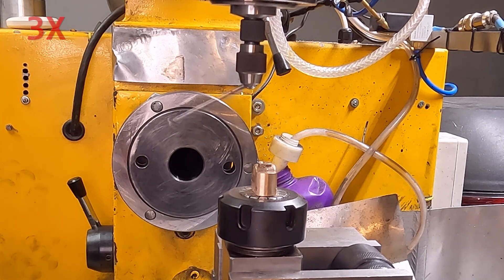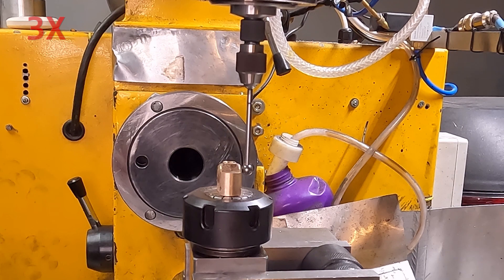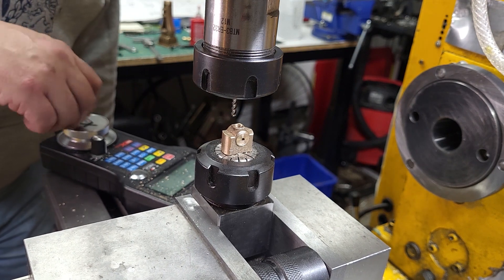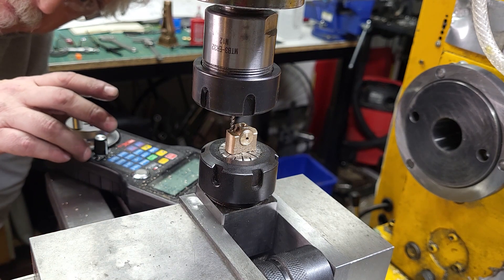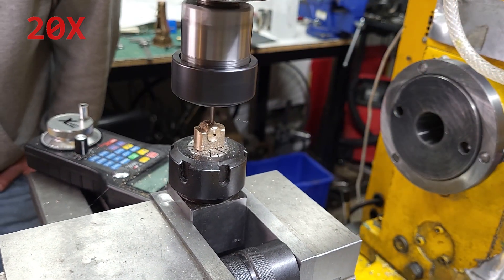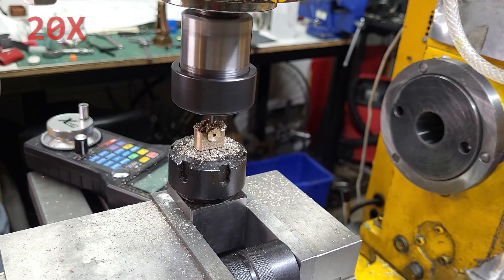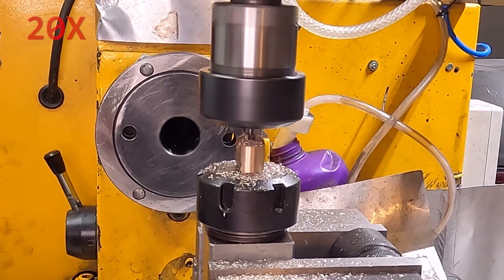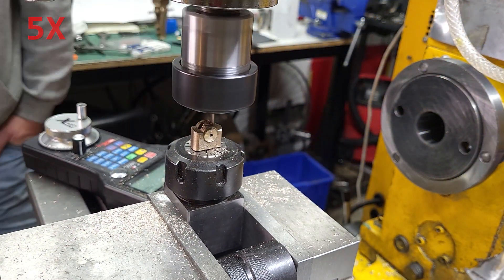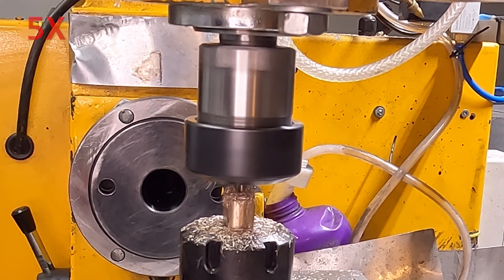With the collet block central we have to find our X zero so we can cut the slot in the end, which is three-eighths down from the face of the casting — not a critical dimension because the casting face is not machined, so I'm just eyeballing that. Then a little ramping CNC G-code program adapted from the valve ports we did in the cylinder, zigzagging and ramping down to the bottom of the hole, then another pass to do a square pass around the slot to widen it out. Perhaps I should have finished with a climb cut, but it seems to work.